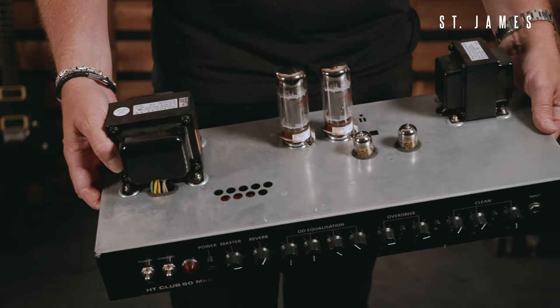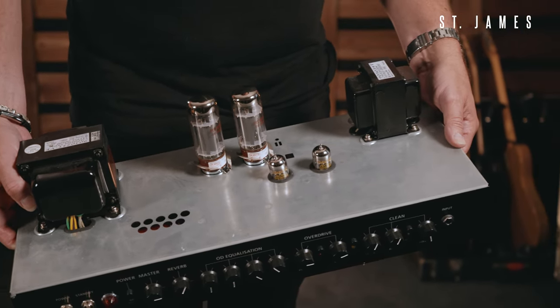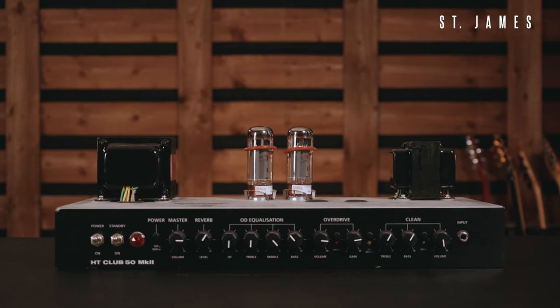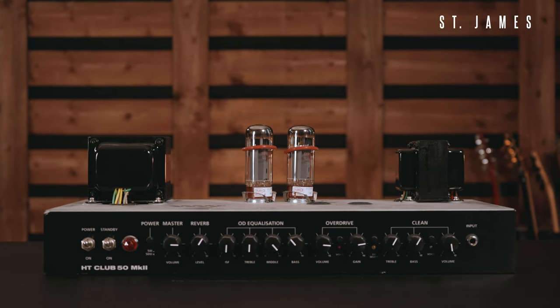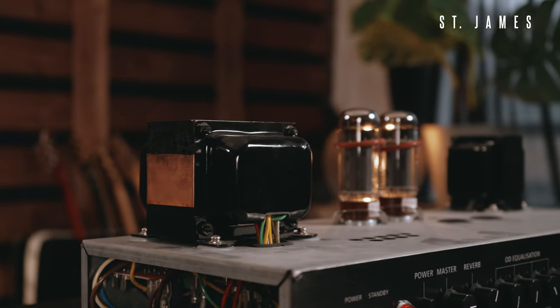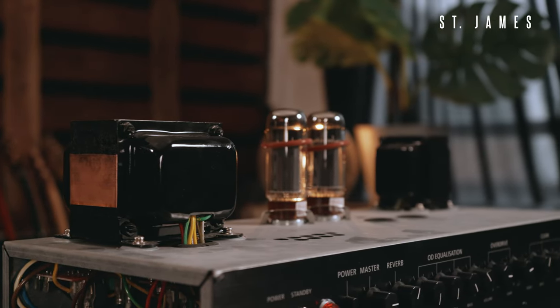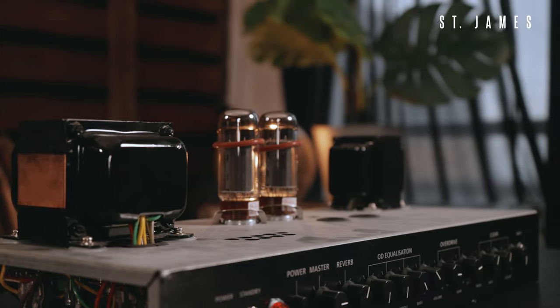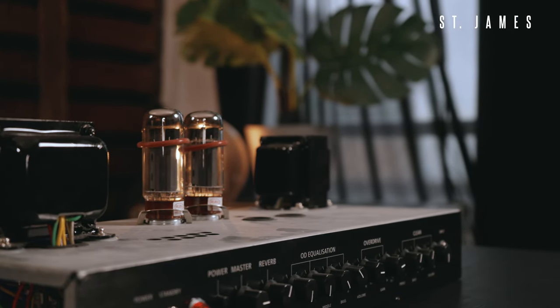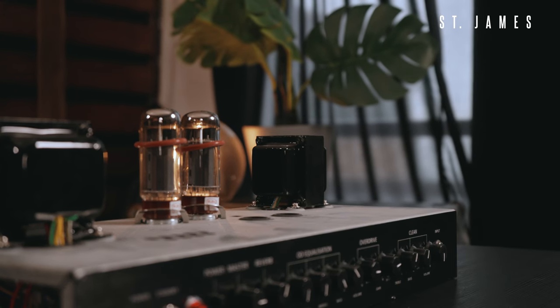To perform well in audio circuits, linear supplies need extra circuitry to smooth the voltages and reduce mains hum from being too audible. Other common issues with linear supplies are that their output voltages vary with changes in local mains supply voltage. This can result in inconsistencies in tone, and they need to be rewired or have a different transformer for territories with vastly different mains voltages, such as Europe and America.